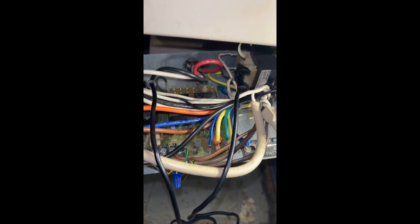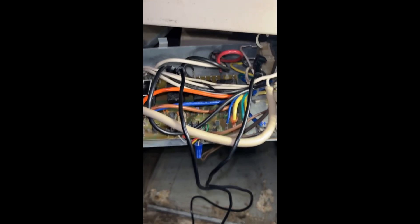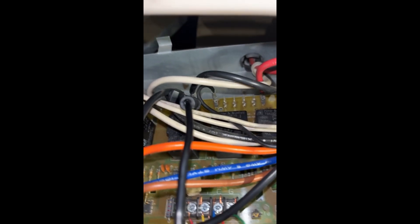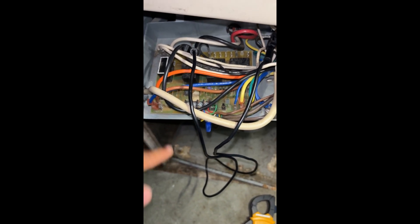What we're going to do now is basically bypass the board and send 120 volts directly to the motor. I got my jumpers — 120 from the transformer going straight to our A terminal, which is AC mode. On the thermostat I got a call between common and G, so we're still calling right now.